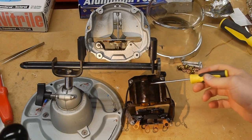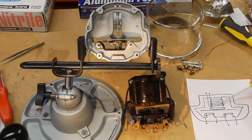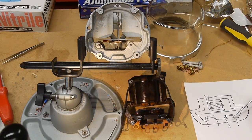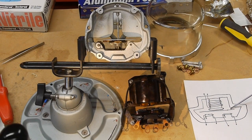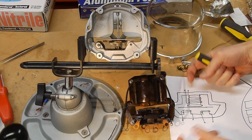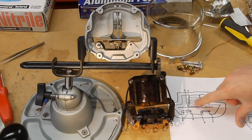Here's the basic design: we've got the voltage coil on the top and the current coil on the bottom. In a schematic view, we have a voltage coil with a lot of turns and current coils with relatively few turns. In the middle is the disc of the meter, and what we do is connect an odometer to the disc so we can count how many times the disc has gone around. The amount of force generated by this magnetic arrangement will be accumulated over time so that we have a running total power usage meter. The question becomes: why have three coils in this arrangement? Why not just two or one offset?